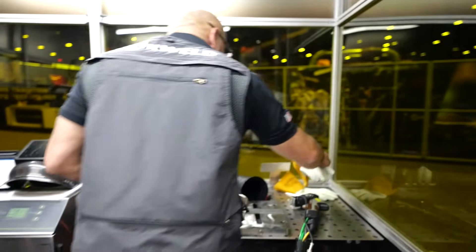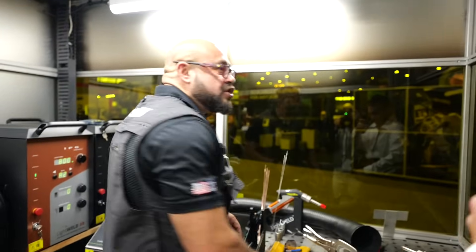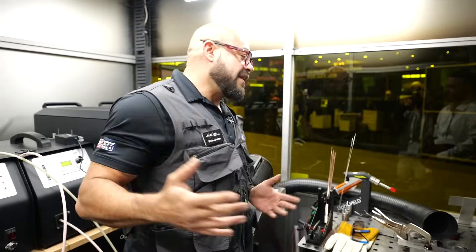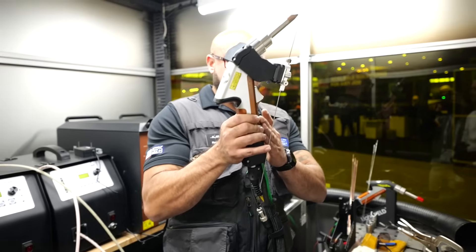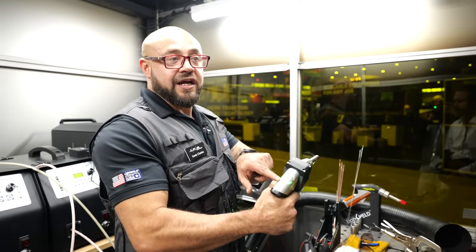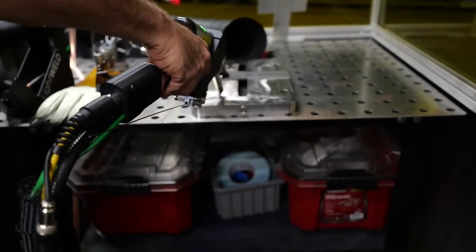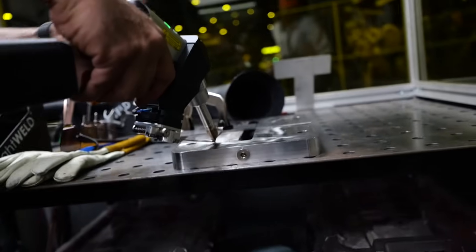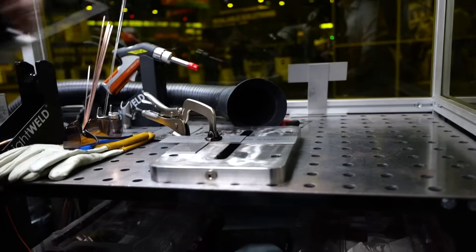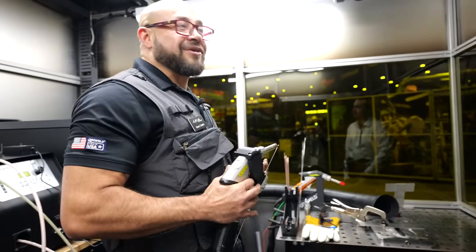So first thing, we want to make sure safety is key. We have a lot of layers of safety built into the machine. We have basic operations of the scrub, a gas trigger right here, and a laser emissions trigger. Once you give it some gas, you get this green light that comes on. As soon as we make contact with the material, this light is going to blink — indicating there is a safety continuity loop that has been satisfied. It will only weld when you are making contact with the material. As soon as you release it, it shuts off. Otherwise, anyone could inadvertently get shot with it — essentially becoming a Star Wars laser gun.